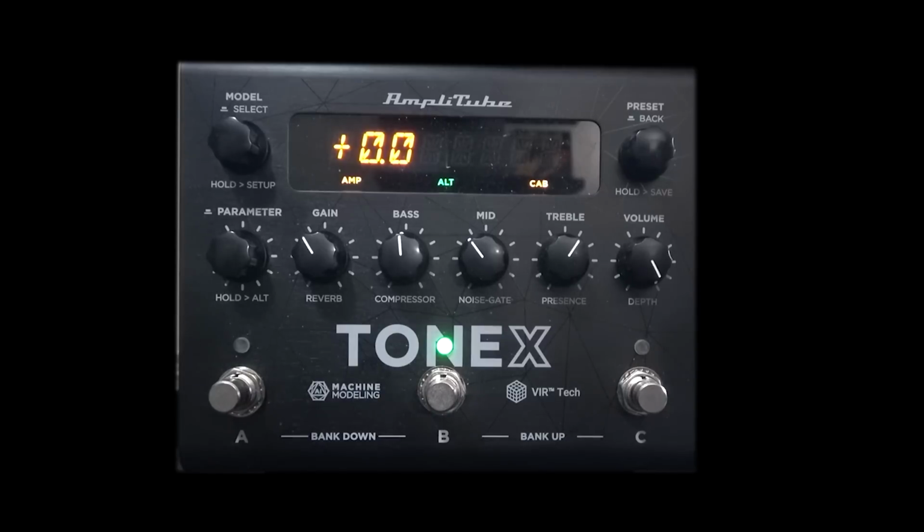You're going to notice now that a 0 dB setting here is going to be much closer to the -9, -10 dB setting that was on the previous firmware. The reason is, as I've already stated, there was an 8.6 dB boost built into the Tonex pedal after the analog to digital converter. So it was essentially boosting that. So it's like putting a clean boost before every tone model. This is why so many folks, myself included, hundreds and hundreds of people contacted me saying that fixed everything when I cut that back by about -10, -11, -12, -9, however much it was for them to get them in the range that was going to work for them.